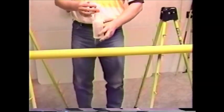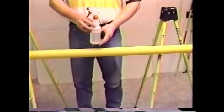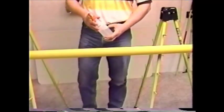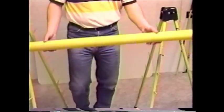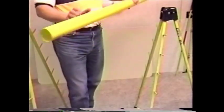Prior to conducting the wet test, there are several important items to remember. First, the water to be used should be distilled. This is readily available and removes the variations in the test due to differences in local tap water quality. When testing hollow sticks, the inside should not be cleaned with a wet type cleaner just prior to testing.